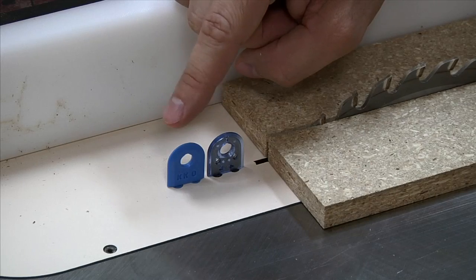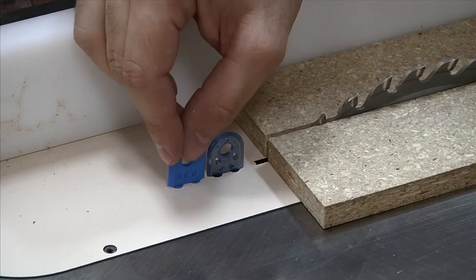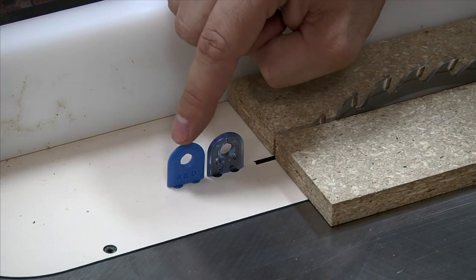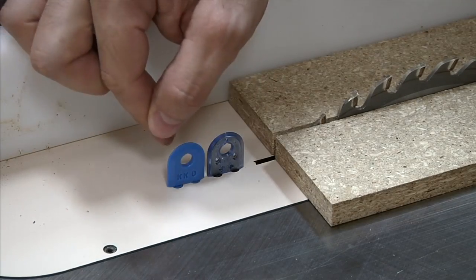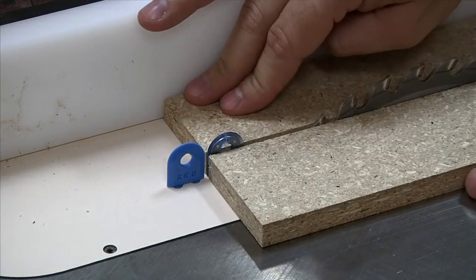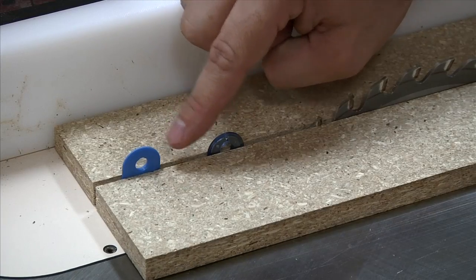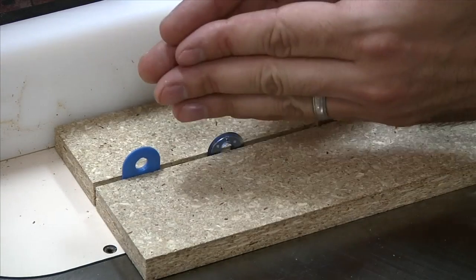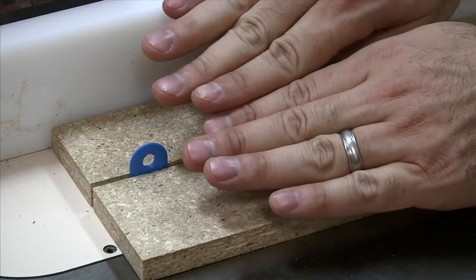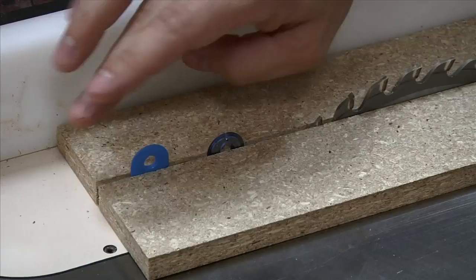A feature I wasn't previously aware of is what they call the kerf keeper. Instead of the double splitter setup, you have a slightly different splitter in the back that fits fairly loosely into the holes — it's a slightly different installation, so you'd probably want a second zero clearance insert for this setup. The kerf keeper is a solid plastic piece that sits in the back loosely, so if a long piece of solid wood naturally wants to bow in on itself and pinches it with enough pressure, it will lift out and you'll see it move. That gives you a visible warning sign that trouble is ahead — you may want to stop the saw and rethink the cut. The second benefit is that if the pieces are coming together, the plastic kerf keeper stops that kerf from closing up, which is actually what creates the kickback risk. The kerf keeper is a really nice safety addition, especially for long solid wood rips.